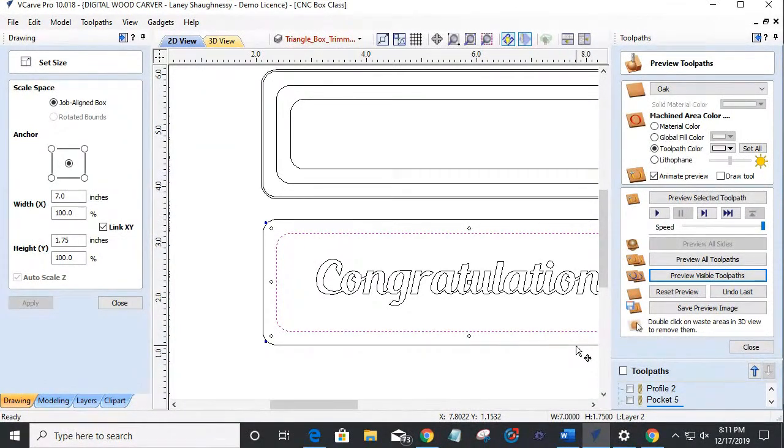There's times, for some reason or another, I might need to go a little bit more, but I sneak up on it. 0.006, 0.007, 0.008, 0.009, 0.01, right? Sneak up on it, whatever you need, but don't make it too sloppy, okay? You want a nice friction fit.